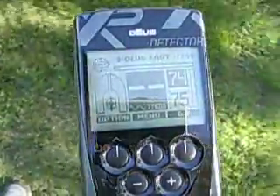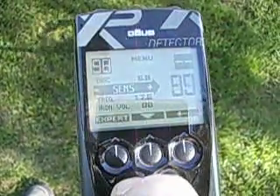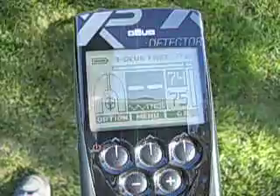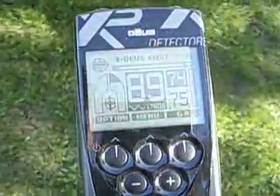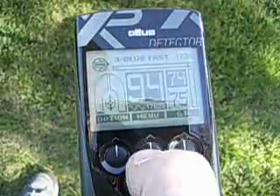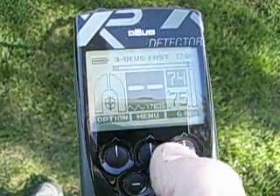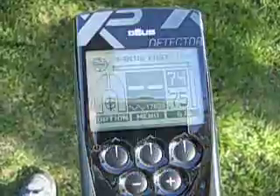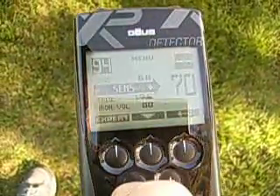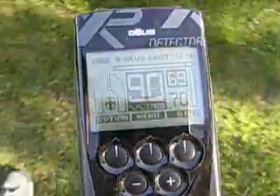So, here's my seven-inch rivet. Good audio. Now at this point I'm going to start dropping the sensitivity down a little bit. You notice the machine quietens down pretty quick when you start dropping off on sensitivity. Still have a good report here of the seven-inch copper rivet. We're going to drop the sensitivity on down a little more. Sensitivity is 70 — everything's staying the same at 17.6 kilohertz. Sensitivity is 60, still good audio.